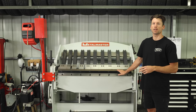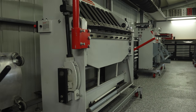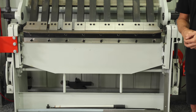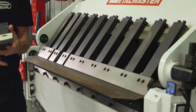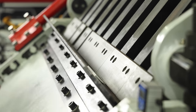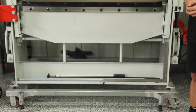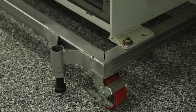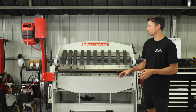This is what's known as a manual pan brake and it has a 1250 millimeter long capacity by two millimeters thick, and can be used on aluminum up to three millimeters thick as well. It's a really handy machine. Each of these fingers is adjustable and removable so you can actually fold boxes on this, which is very handy when it comes to building aluminum sumps, fuel tanks, and anything that requires a nice corner to be folded and then welded. I've got this on caster wheels using a 50 by 50 square steel tube base, which allows me to move it around the workshop and push it hard up against the wall.